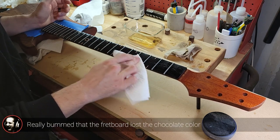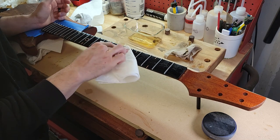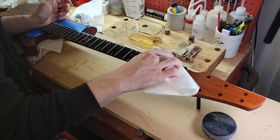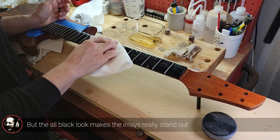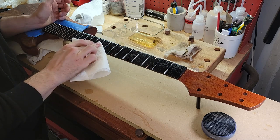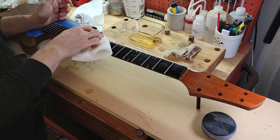Now what I'm hoping is that a small, thin film of the oil will remain on top of the copper, which will help it keep from having a patina later on. Now, long term, that might be ideal, but not when it's fresh, because copper patinas pretty quickly. So I'm hoping it'll stall that action, at least for quite a while.